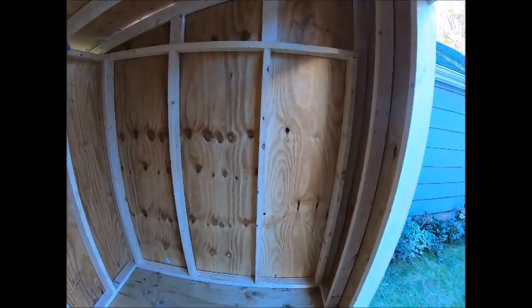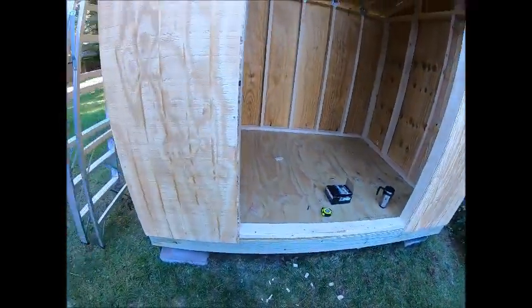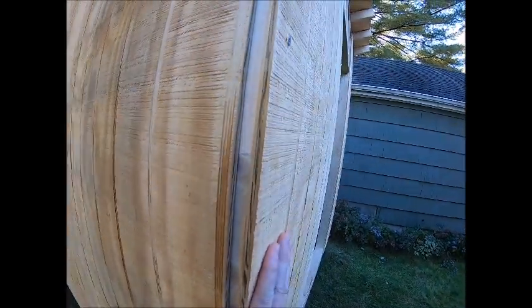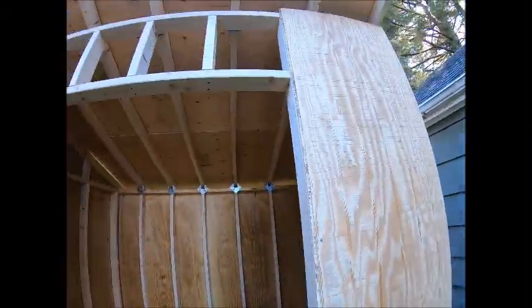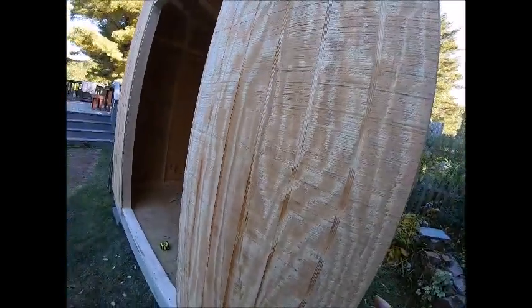And I did make one mistake on this that I didn't even consider. This T111, it's tongue and groove, so you actually lose a 1/2 inch. Now fortunately the trim boards will cover that, but it wasn't something I actually even considered. So that might be an issue when I go to fill this section. But maybe I could just do trim boards there too.